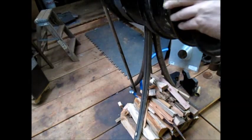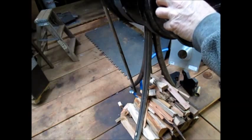So then it goes all the way through the floor and back up into the wood stove, so it's a circulating unit. And now I also understand that it's not going to circulate on its own, so I've got a little water pump that's going to go someplace in this line here. Maybe not here, maybe in another part of the building, but somewhere there's going to be a little water pump that's going to be circulating that water. So hopefully by the time I get this thing all hooked up, and I'm going to work on it today, it should warm this shop up a little bit.